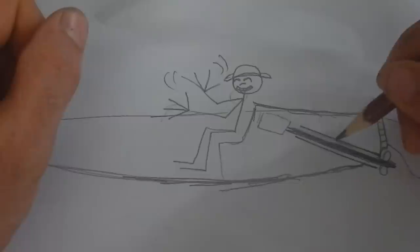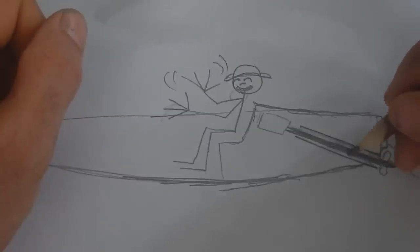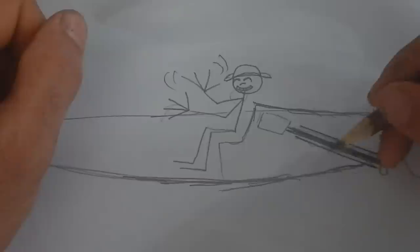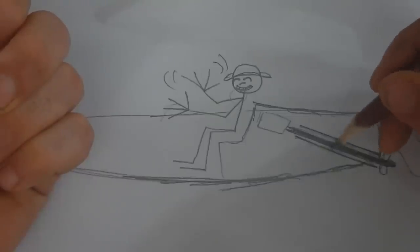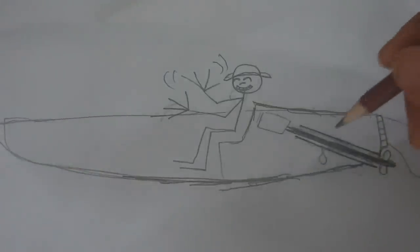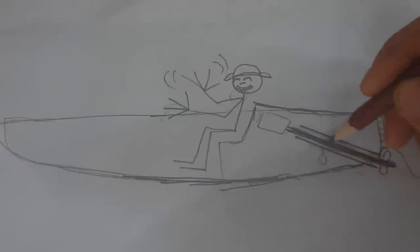I'm pretty sure it's also hitting the internal wall of the tube it goes through. There's a bearing down here, but there's no seal so water can get in. There's a tube that comes all the way up above the water level, so water can come up but it doesn't actually come into the boat. If the pipe is hitting the side of the tube every rotation, that's slowing it down a little bit every time — and it could eventually wear a hole through the tube. I want to get rid of all the resistance this bent tube is causing.